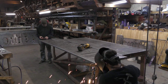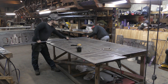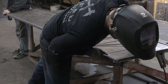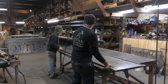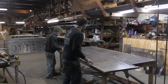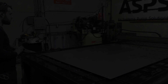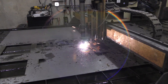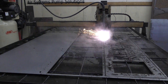Doing a little bit of cleanup anywhere the plasma table didn't make a perfect cut. Now we're welding up the top that will cap everything off — it's just a piece of angle iron with some end caps on it, so it kind of slots right onto the side. Then we weld out the frame, finish anything up, put in some gussets for mounting this to the wall. That top cap attaches right to the frame with just five holes drilled into it, and we use some pan head self-tapping Phillips screws. So when you're below looking up at the side, you can't see any fasteners whatsoever. This is actually a two-part project — there's going to be the sign on the building, and then they have one in their lawn so you can see it from the street.